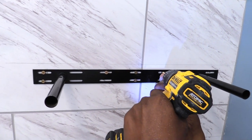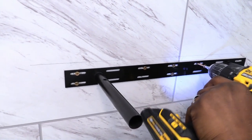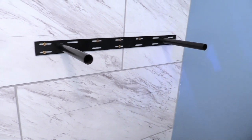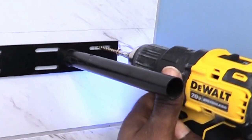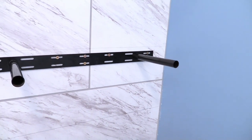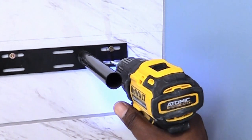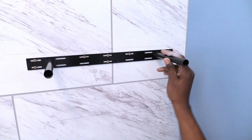Make sure you watch and protect your fingers while working with power tools. Here's a tip: take your time so that you install your shelf right the first time. During this step, the goal is to make sure your shelf will not sag or come off the wall over time. As you can see from the amount of screws, this bracket makes it easy for your shelf to remain strongly against the wall. After you tighten all your screws, give the bracket a tug to make sure it is secure.